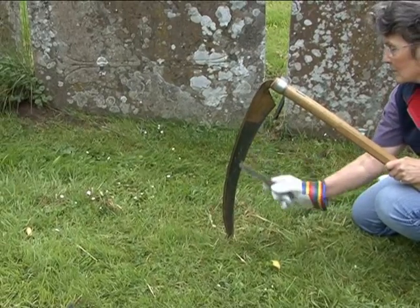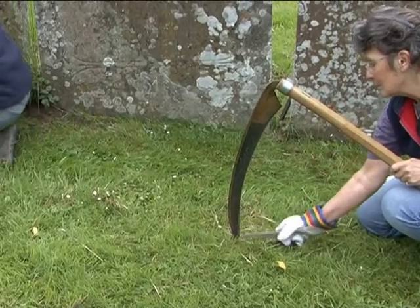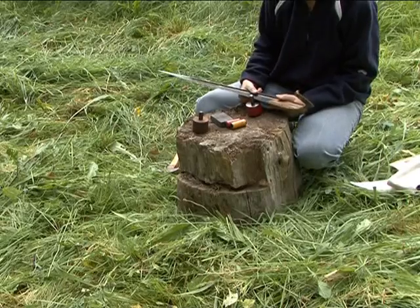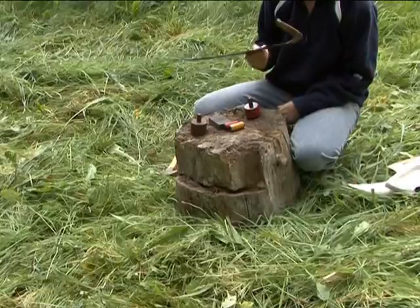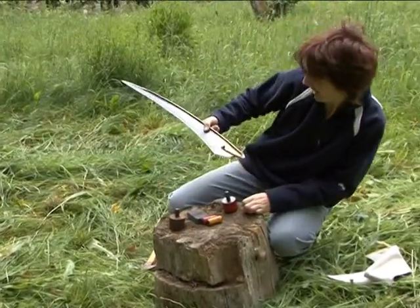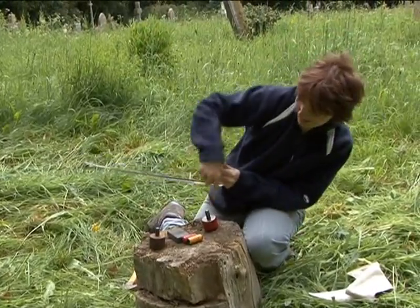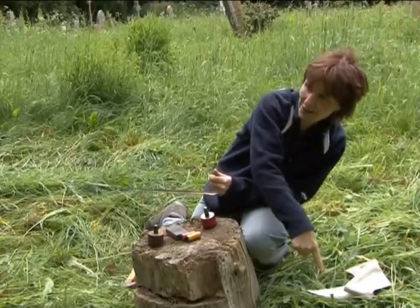After about 4 hours of use, the sharpening stone no longer gets a keen edge on the blade. Now it is time to peen the blade. Peening is cold forging. Basically, you want to flatten the metal. This gives it a better profile and hardens it.